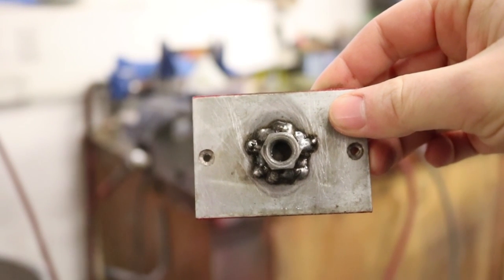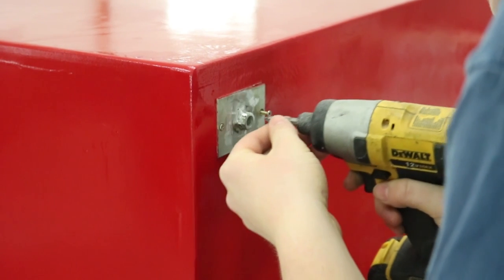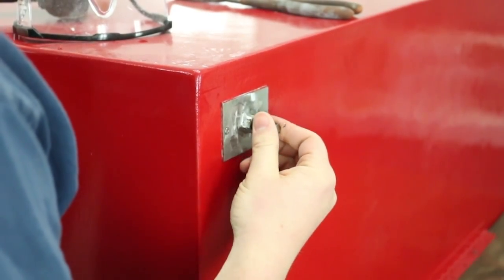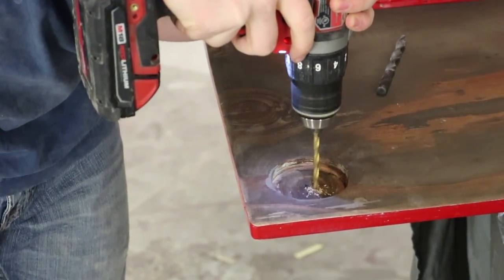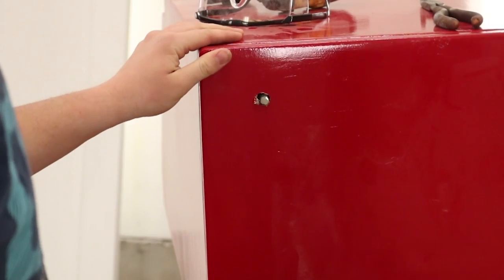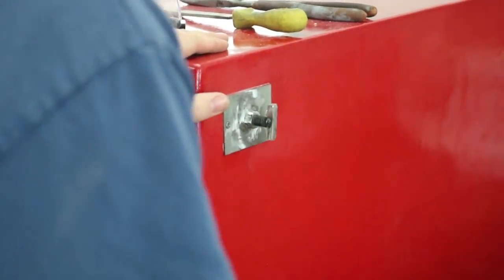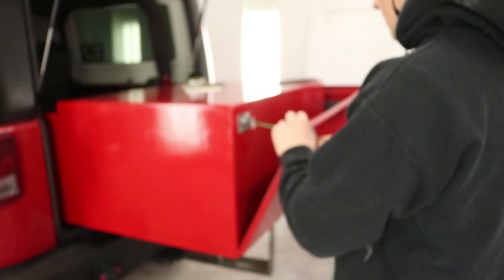This is a plate design I made. It holds the table up instead of that magnet idea from before. I didn't like the magnet very much, so I replaced it with a nut welded onto the plate and then I screw a bolt in there. I cut the head of the bolt off, found where it was on the table, and drilled a hole for it — fits right there, nice and snug. I welded a little cross member there so it twists on and off. You can just put it up there and twist it instead of using a magnet. The magnet kind of fell off, so I felt this was a lot sturdier in the long run.